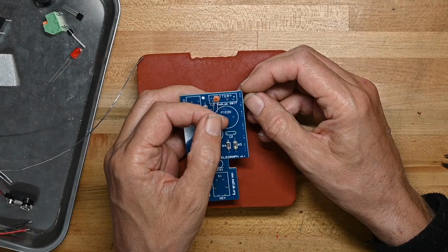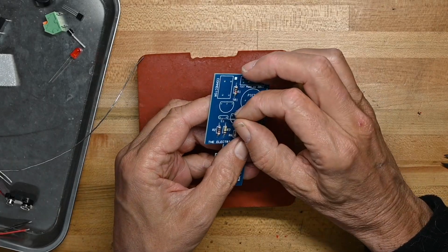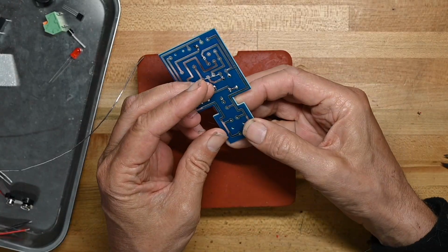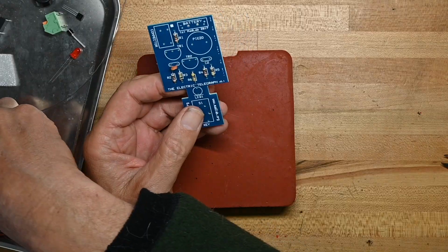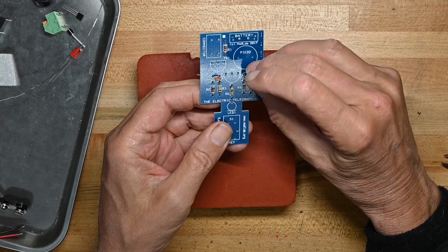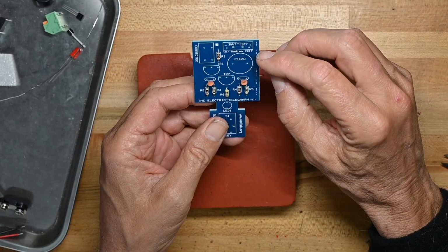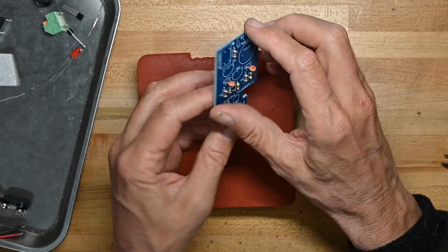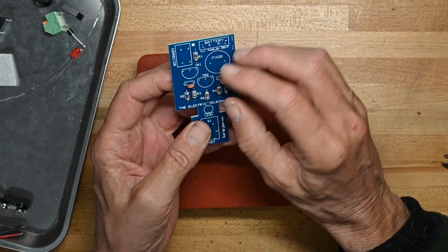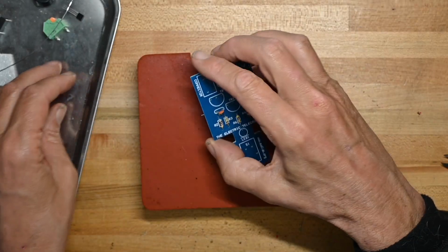Now we'll do the two capacitors. They're 4N7s, so that's 472. That's 4 7 and 2 zeros for 4700 picofarad, which is 4.7 nanofarad. So one resistor is for the LED current limiting. R2, R3, R4, and R5 are to make the little oscillation that'll make the piezo go off. I don't know if the other one is connected to the connector or not. Let me see. So the connector comes from, yeah, it's coming from the 2 transistor bridge. I don't know if that's, they don't include a schematic. So those are the 2 capacitors.